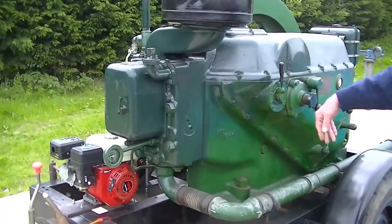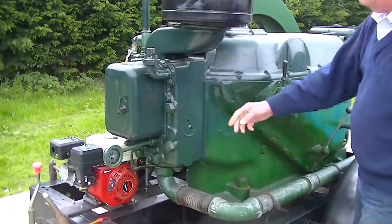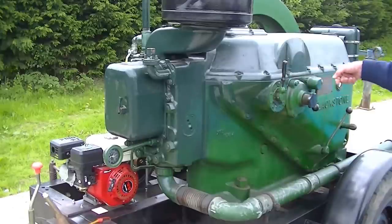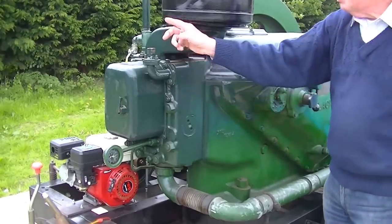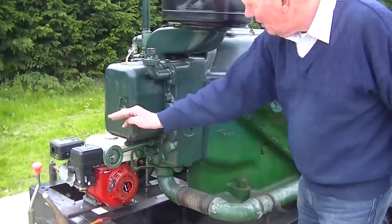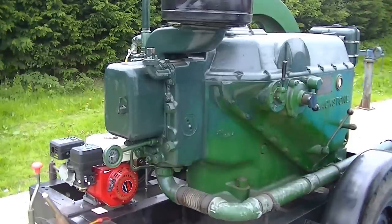These are the controls for the engine. This one turns the fuel off and on. This is the actual throttle, and this is what allows it to start on air, which normally comes from high pressure bottles. But when you have the engine running, you just turn the fuel off and then move this lever into a different position. The weight of the flywheel causes the bottles to be recharged with fresh air that enters the cylinder — so it acts like an air pump as well. This just shows the cylinder head temperature. And this is the pump to prime the bearings with lubricating oil before you run it.